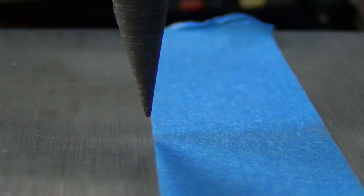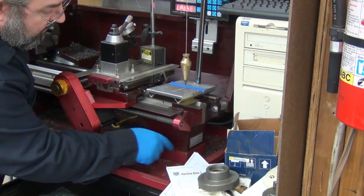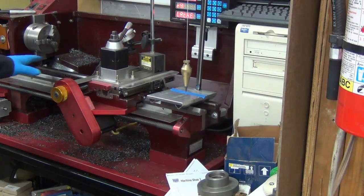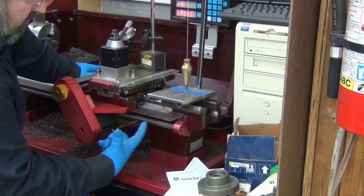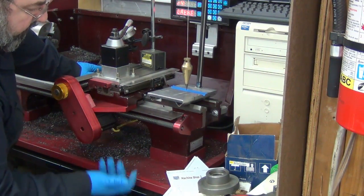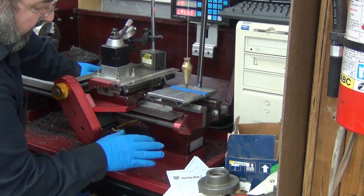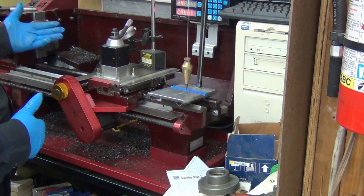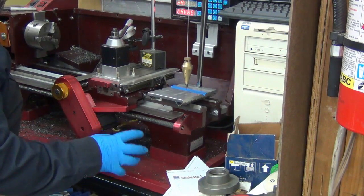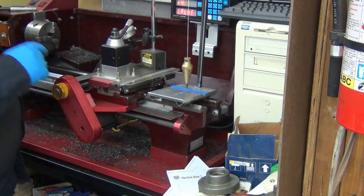I like that. Now the question is how to get the lathe to match up. I'm going to come in here, loosen up the bolts, and try to get the shim stock in. I'll go back and double-check the left side. What I did was the two bolts that bolt this block to the table - I got in through the drawer, loosened them both up, pried the block up off the drip pan, and put in 3-thou shims. I already had them cut, so I figured we'll see how close they are.